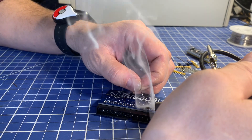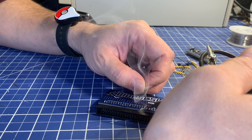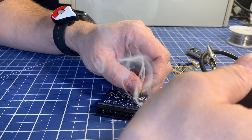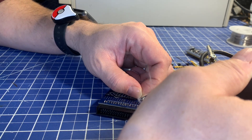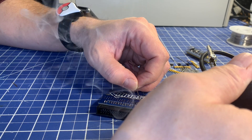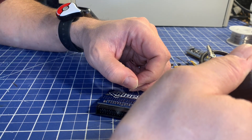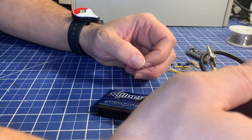You don't typically need a ton of solder on these connections. These are through-hole, so the board has solder pads on both sides. You typically want to get enough solder to flow through to both sides, but since it's all electrically connected, if you have not quite enough solder it will still make a connection.